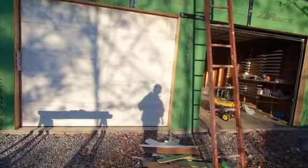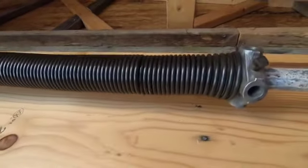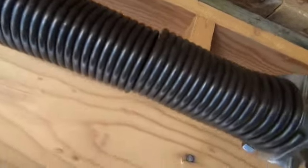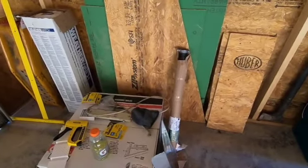I've got my garage doors put in — they're not bad looking for used garage doors. They've got a couple little scuffs, but they're in pretty decent shape. This one does have a cracked torsion spring. I don't know if you can see, but there's a crack in the torsion spring right up in here — it's deformed right there, so it's not going to make it too many more revolutions. But I have a replacement torsion spring ready to go.